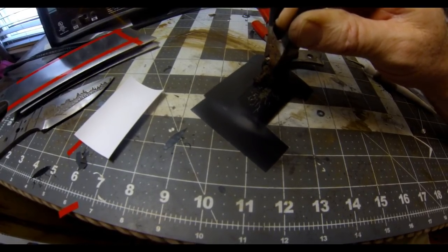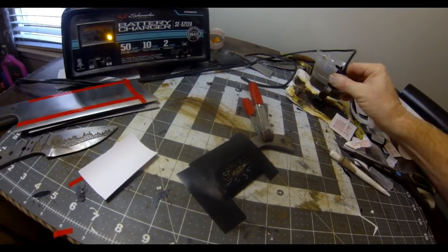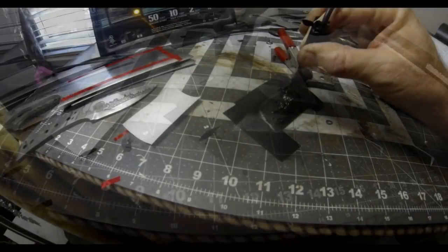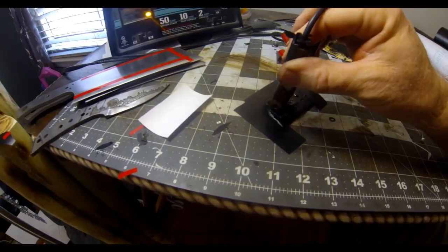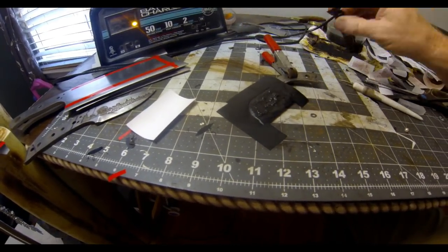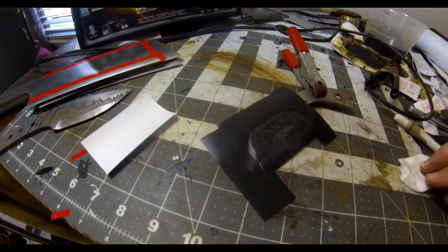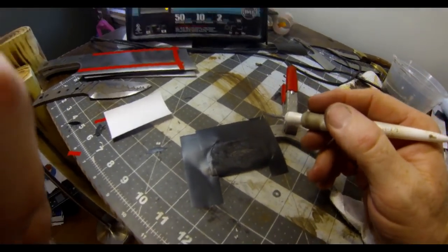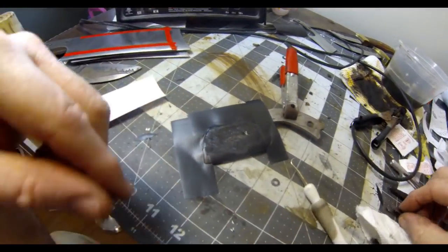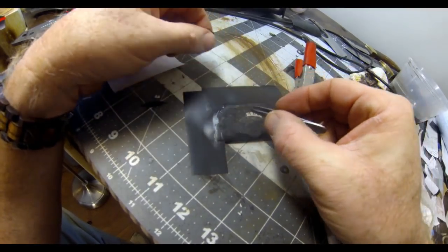What I'm playing with here is a two-tone etching. This is a hole or crack design and I want to give it a 3D effect. To do so, a portion of the design is going to be etched not as deep as the rest. I'm etching each area of the stencil for about 60 seconds total — 10 to 20 seconds at a time in each spot — so the vinyl doesn't heat up too much and lose its stickiness. Then the area that's going to be two-tone: I'm going to remove the vinyl from that area about halfway through, and then continue etching everything again. The vinyl I'm removing is the portion of the design that should end up a little bit lighter in tone.